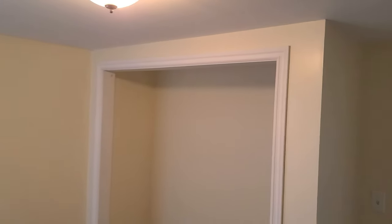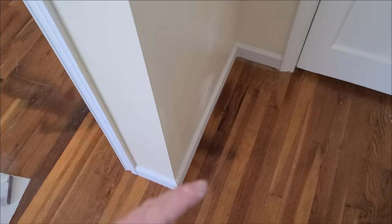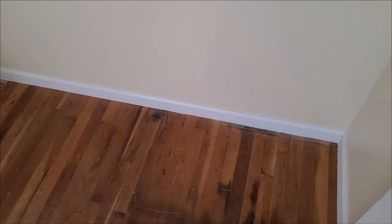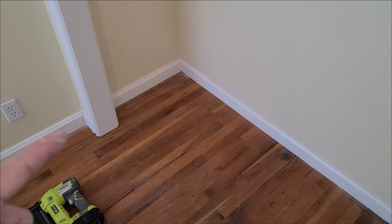Through the magic of video editing, all of the paint is done - two coats. Have to do a little touch-up on the ceiling in this corner, then paint the trim and put the baseboard in, and then we'll hang the doors. The new baseboards are in - these are all MDF factory Home Depot style, and so are the others. But the one that runs along this exterior wall is an original baseboard for this house, which was kind of fun to fit. This corner's a little janky but I did what I could.